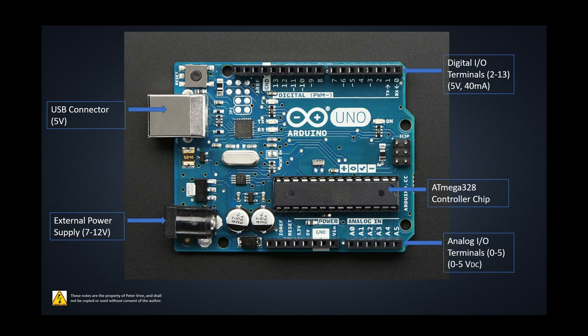In addition to that, we have analog I/Os on the bottom — six different terminals. They'll take a zero to five volt DC signal in and use what's called an analog-to-digital converter. They take the analog zero to five volts and change that into a digital binary number that corresponds to each of the different voltage values you're putting in. So as the zero to five volt input increases, the analog-to-digital converter changes that to a matching binary value.